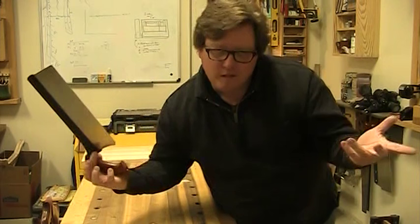If it isn't perfect, back that screw out and do another screw — by having four holes there, it gives you four chances to get it dead on perfect. To do the other side, flip it over, pop it down, run a bead of glue, clamp it, then drill the screws in. If you get it right, the knife line from the bottom is going to line up with the knife line on the side, and your saw kerf will be over on the edge. If you get it a little off, unscrew it, wipe off the glue, line it back up, drill new holes ignoring the old ones, and get it right.